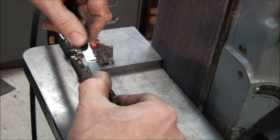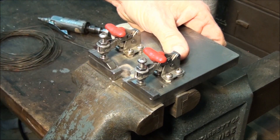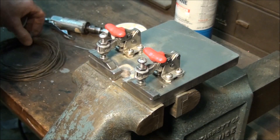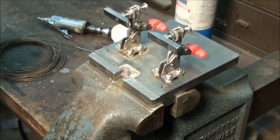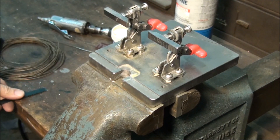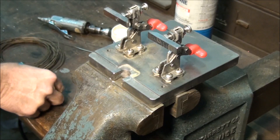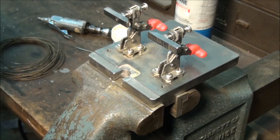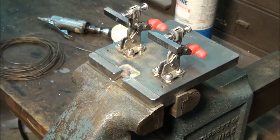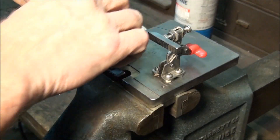Now we'll move over to the bench and I'll show you how to solder this together. The key in the bottom of the fixture does double duty — it lines up in the belt sander but also gives you something to clamp on, put in the vise, which makes it easier to use. To prepare the blade, take a piece of Scotch-Brite and scrub off the bluing off the blade so it doesn't interfere with the soldering process. Then center up the scarf joint in the slot and lock it down.